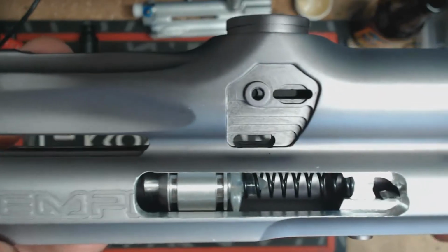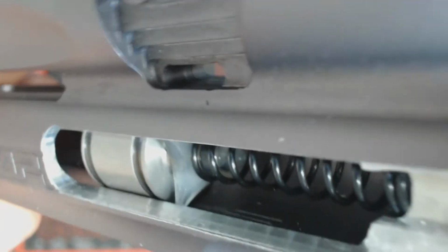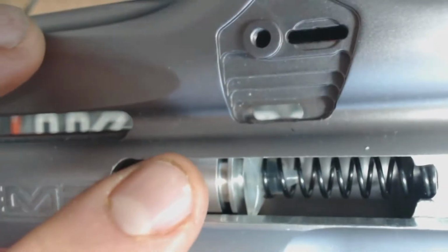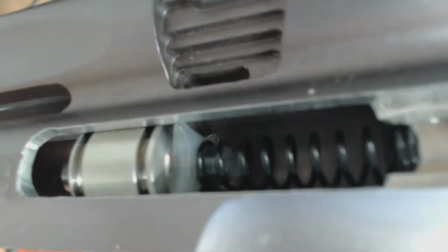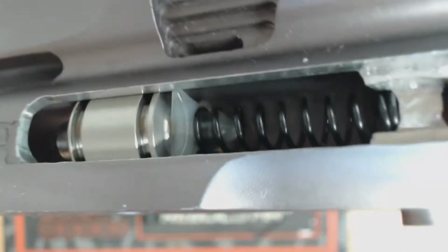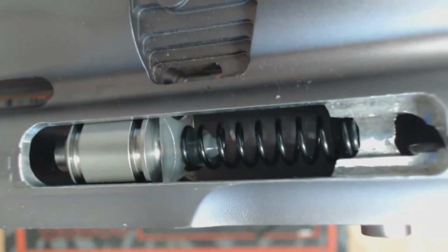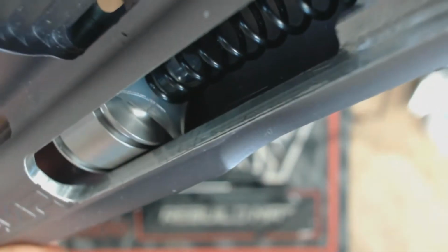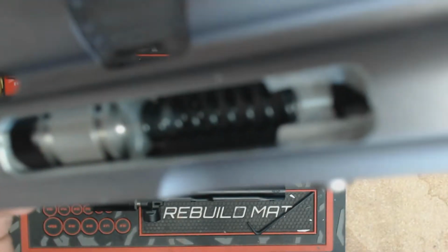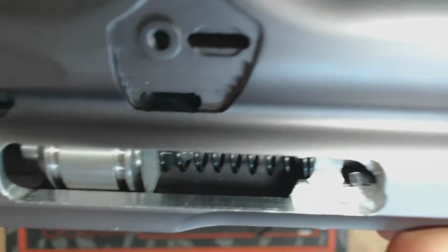One of the things when looking at it this way, which you can't see in a normal body, is the valve itself. The body is the big silver round piece, and the valve is actually the pin with the spring on it. And the sealing surface of that valve, that plastic, molded nylon, whatever it is, if you notice, the tips of those stars are the right diameter, so they actually ride on the inside diameter. If I can get an angle on this thing to see there, and get it to focus, there we go. See, they actually ride on the inside there.